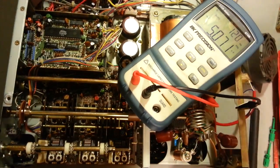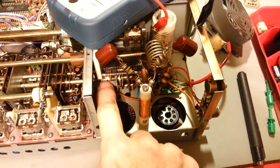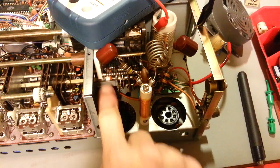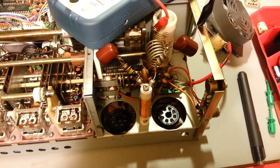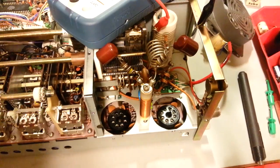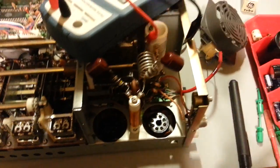It's when someone put that little flex coupler right there. If I turn the control, you can see it spinning around there. They put it in the wrong orientation. They're off one notch on the channel selector. But like I said, I wanted to show this.